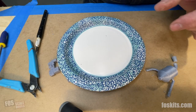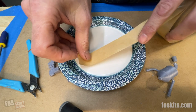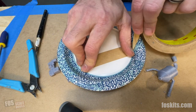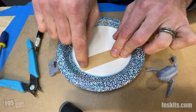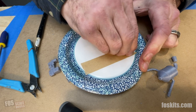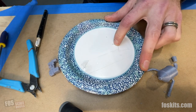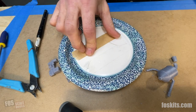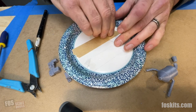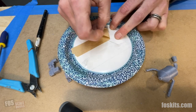Now we need to prime these parts, and you're going to do so just as you would with metal castings. Other than the cleanup of those little supports, it's very similar to painting castings. I've got a paper plate here and I'm putting down some 3M tape so I can stick my details to the plate so they don't fly away while we're spraying them.